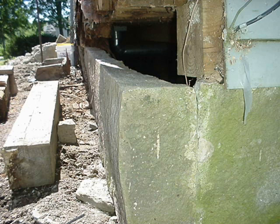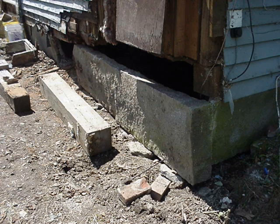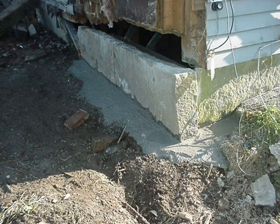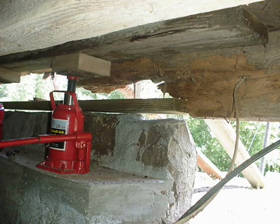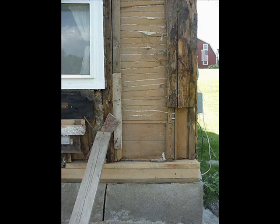The first thing I had to do was get the stones back in place — these big granite stones. I didn't just want to stand them up and set the house back on them. So what I did was go up under the house, build forms, and pour about 2,000 pounds of concrete, all of which I mixed with one of these little automatic mixers, in that whole corner. I filled it up with R-rod and made that whole corner solid. Then I was able to jack the house up, working from that concrete once it dried, and chip away all of the old sill.